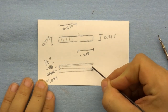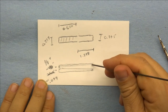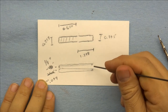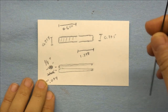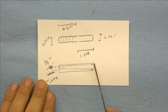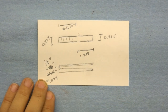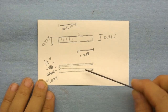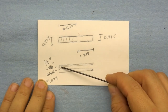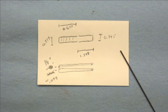This down here, we want it to be as wide as it can be because that's where we're going to be connecting up to the draft hole in the shank, which is quite a wide bore. And in both instances, we want these to basically be flush fit. So we don't want to have any space on either end of this because that's going to lead to gurgling of the pipe. Likewise, if we were to just drill this straight through, you'd have a step here, and that could lead to gurgling. So it's important to get these dimensions right.